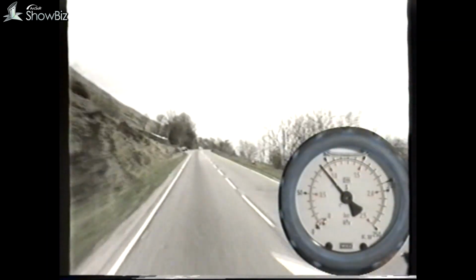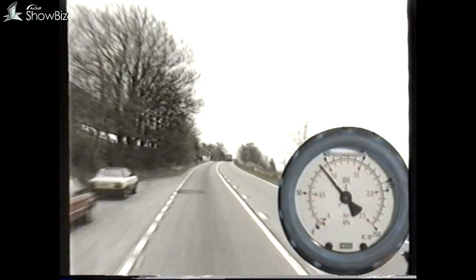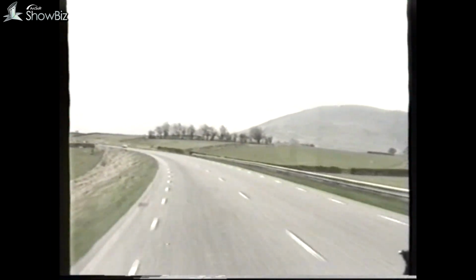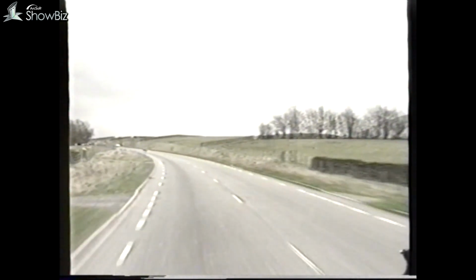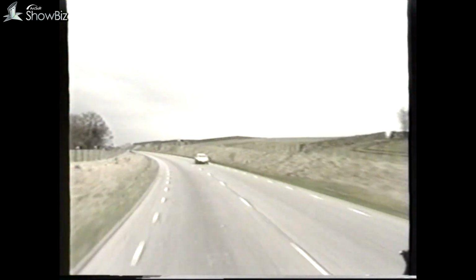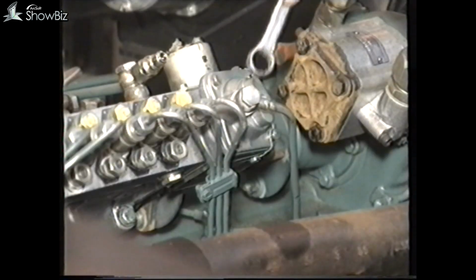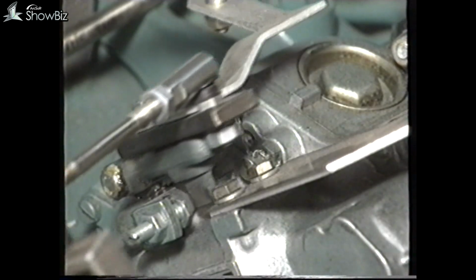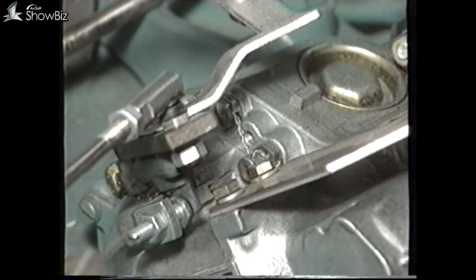It should be noted that if the engine passes through the 2,200 RPM band too quickly, there will not be sufficient time for the turbocharger pressure to stabilize. Therefore, you will have to select a slightly steeper test gradient to achieve the correct reading, or alternatively, partially apply the brakes. If the reading is low, check for air leaks on the inlet manifold joints, the boost control pipe, and finally ensure that the fuel pump is receiving full throttle, as underfueling will also give low boost pressure readings.